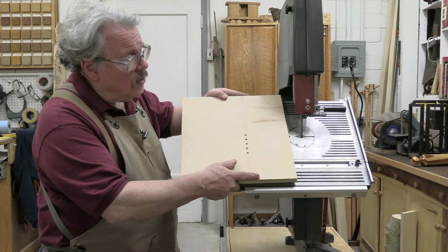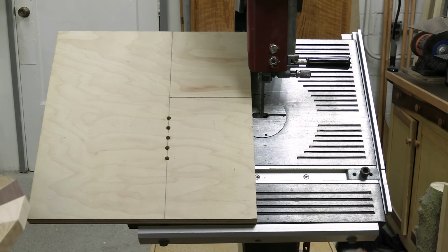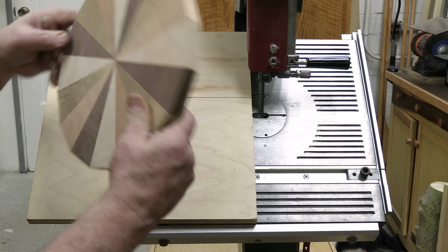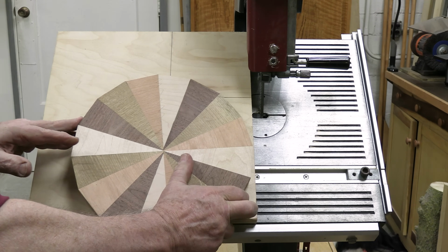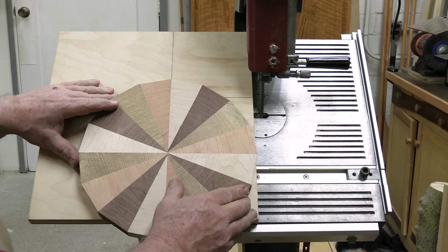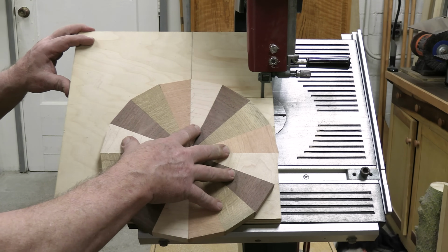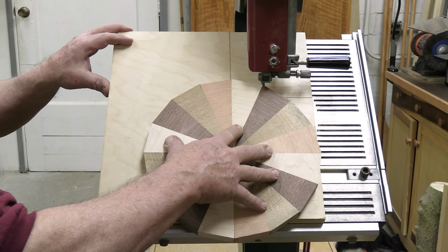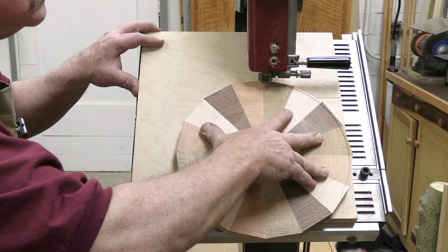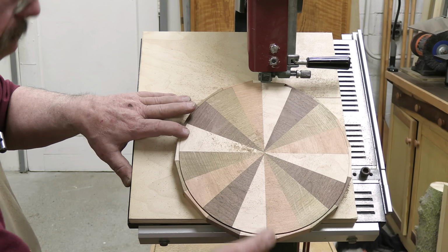Place the jig on the infeed side of the bandsaw table, back from the blade. Make a short pivot pin from steel rod stock and insert the pin in the bottom of the stock that you are about to cut. Then insert the protruding end of the pin into the first pivot hole, the hole you will use to cut the largest diameter. Rotate the stock into position and turn on the bandsaw. Advance the jig until it hits the stop, then begin to rotate the stock. Cut a complete circle, stopping where you started. Turn off the saw and carefully back out of the cut.